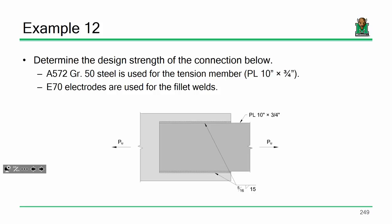Clip angles are usually made of weaker steel — angles are typically A36, they just might be thicker. The big thing is just to make sure you're match drilling so that the holes line up. Any other questions so we can get into some welded connections?